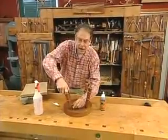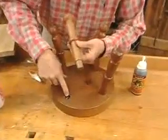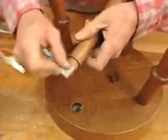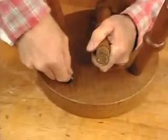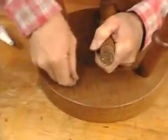Here's a great way to fix legs that have become loose. Look at this — that's the tenon, and this is the mortise. The first step is to use 100-grit sandpaper to scarify or rough it up a little bit, both on the tenon and also on the sidewalls of the mortise, just like that.